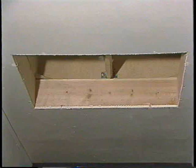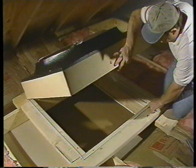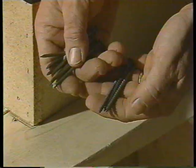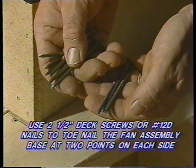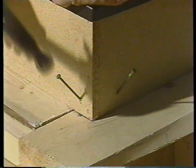Place the fan on the facing with the wood frame down and the plastic shroud up. Before securing the assembly, place a foam strip between the facing and the fan housing — this virtually eliminates the possibility of any noisy vibration. Center the fan assembly on the facing and draw alignment marks on the facing to use as a reference in case the fan moves during mounting. Use eight 2½-inch deck screws or number 12D nails to toe-nail the fan assembly base at two points on each side onto the facing. Re-check against the marks to make sure the assembly has not shifted.